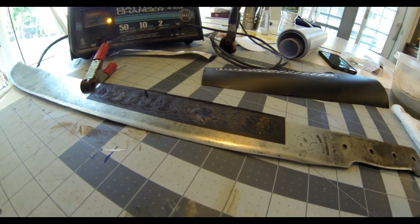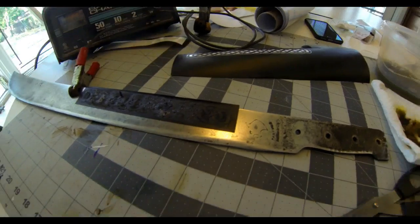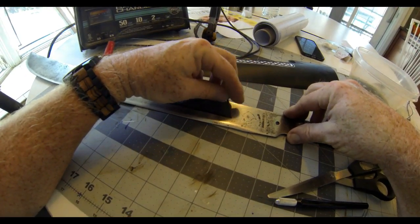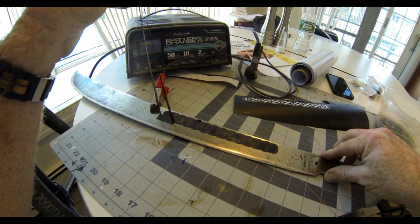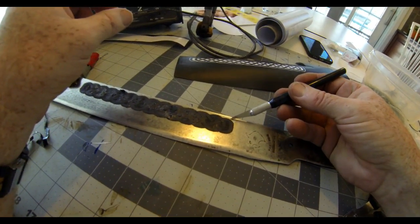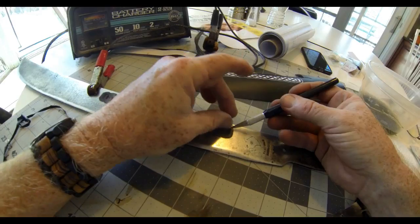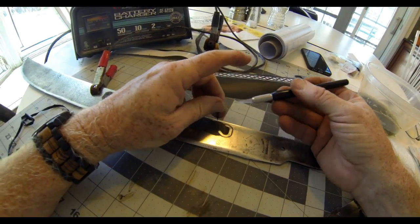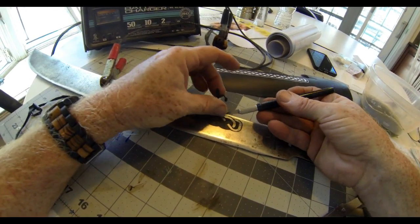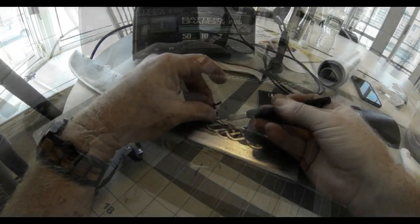Every inch of that template has been etched for a total of about 30 seconds. After I've made all three passes — I limit each pass to 10 seconds so the vinyl doesn't heat up too much; I'm always fearful I'm going to lose that template and ruin my etching. After all three passes I turn off the battery charger and use a little razor knife — or you could use tweezers — just to peel off the vinyl. That will expose the portions that are etched. I'll clean it up with an alcohol wipe and then very lightly sand it with about 500-grit emery paper.